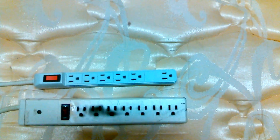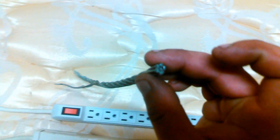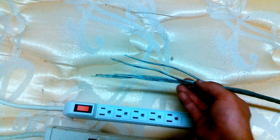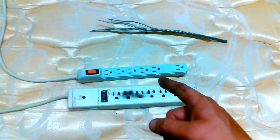This was all caused because the power line — here's the section that was cut off, that's the fresh part — it's made out of seven-strand aluminum and was just gone, corroded, bye-bye. It finally snapped, and when it did, the system started trying to use something else as a neutral.